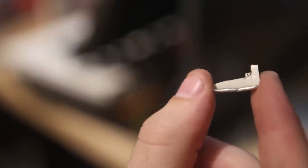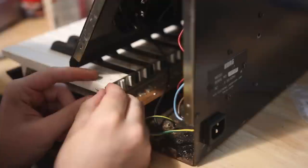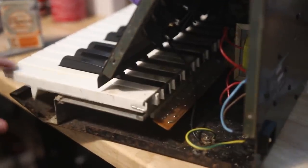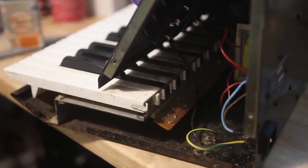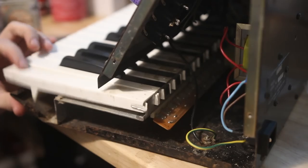I clipped out just the right shape and glued it to the side of that key while it was in circuit and everything. Quick, easy, cheap, and it totally works. And especially lucky because this was the furthest right key, furthest out to the side, you know what I'm saying? I didn't need to worry about sanding it down to get it exactly in line, so I didn't rub against the key next to it. I had enough clearance that I could just stick this on the side.